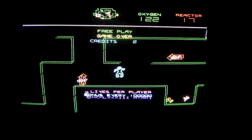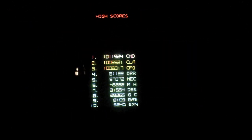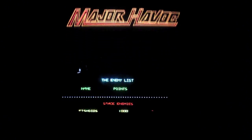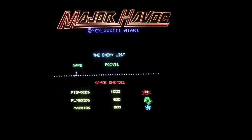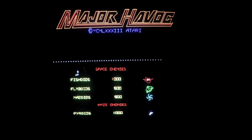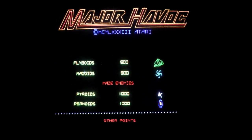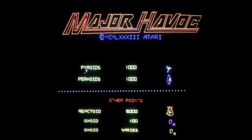And when we switch to the Wells Gardner — that was the Amplifone, now here's the Wells. Right away you see the resolution difference. You can see the stair stepping on the letters there. Not as high a resolution tube, so you get a little bit of the jaggies, some people call them. It doesn't have anything to do with speed right now because you can see the text at the top is not moving — so that's purely resolution.